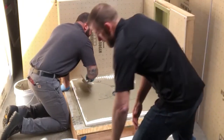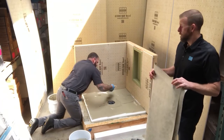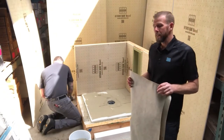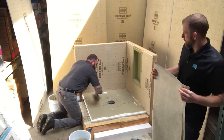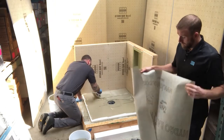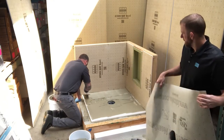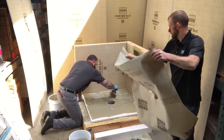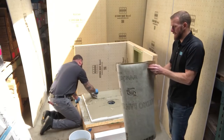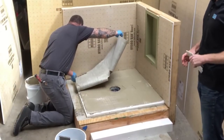All right, as I mentioned, a piece of fabric comes with the pan, whether it's a la carte or kit. The sheet is going to fit the exact dimension of the pan out of the box, okay? We cheated a little bit. We pre-cut the hole, just saves some time. Pre-cut to pan size helps out with speed. Okay, we're fully troweled out, ready to roll.